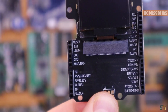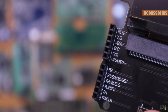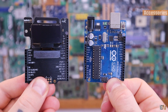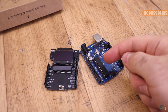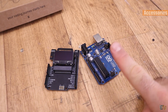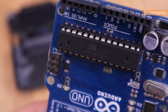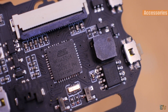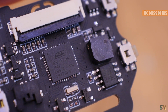Here we have the power pins, the analog inputs and the I2C port, and on the other side we have the digital pins, the UART and SPI ports and all the pins the Arduino Uno should have. But have in mind, the WatchX PCB uses the ATmega32U4 microcontroller, which is the chip for the Arduino Leonardo and it is a little bit more powerful — not the same as the Arduino Uno.